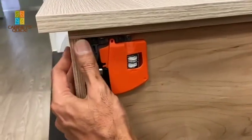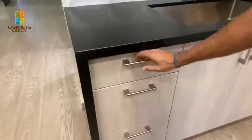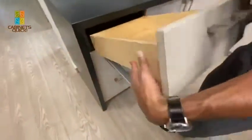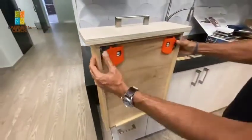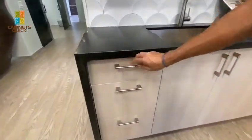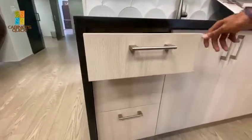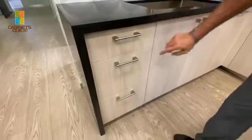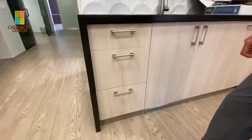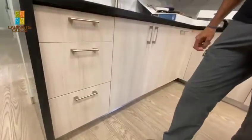This lets you bring the drawer box higher. So suppose we went to the highest setting. Now the drawer box moved up. And if you wanted to bring it down again, you bring this down. And drawer box came down. So these clips are very versatile for tuning and adjusting your cabinets so that all the gaps and reveals are equal. And equal gaps and reveals are a hallmark of good quality cabinetry. Whether the gap is a little wider or not, as long as they're equal, that's what you're looking for.